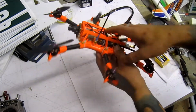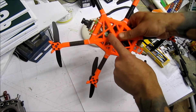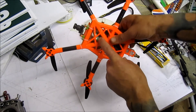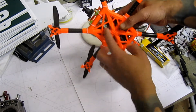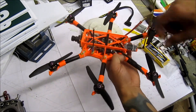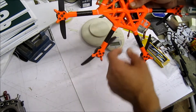There's another cool feature — a three-in-one thing on the board: a voltage sensor, a buzzer, and a U-BEC. The U-BEC gives around 5 volts at about 1 amp, which is why I had to get a separate step-down module to power my Mobius. There's also a DIY video filter, and she's good to go for maiden.